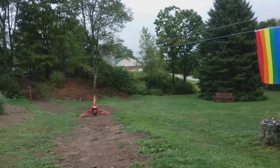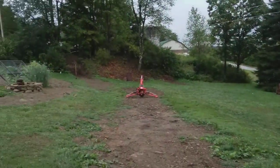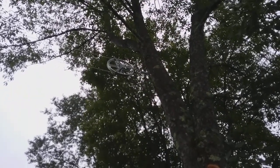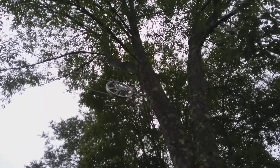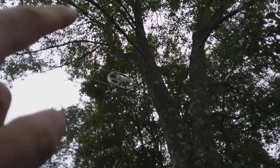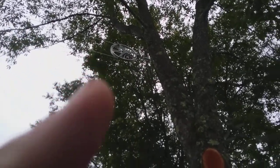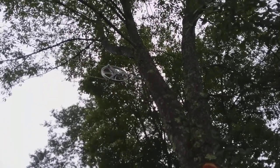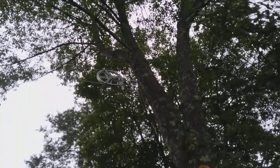There is a little bit of concern about this thing in high winds — the trees kind of swing back and forth. The people that make these, I called out to Ohio, and they suggested I put a spring in. Right behind the 16-inch dummy wheel there's a pretty heavy spring. I didn't know what kind of spring to put in or how much tension it would take, but I ended up getting porch swing springs — they came in a pair. They actually work on compression rather than tension, which is kind of odd. The hooks on either end pass the whole way through and squeeze on the spring. I've lost most of the travel on that spring, so it's probably not appropriate — I probably need something a little heavier, but that's going to do for now.